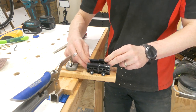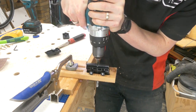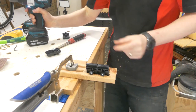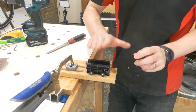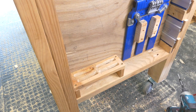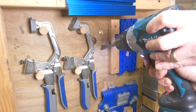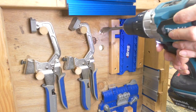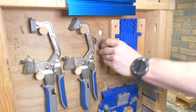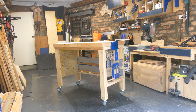The last thing I wanted to add was a home for the clamping plates - these can be used on the bench vice or on the bench clamp track. Some quick jigsaw action, a bit of filing down, and I didn't quite get it right the first time, so I used the drill as an end mill to make the hole a little bit bigger so they'd all fit nicely. I screwed that down, and also forgot about the bench dogs - these sit on a tiny slight angle, just with the 19mm speed bit. They'll live there nice and snug out of the way.